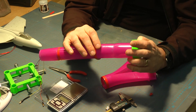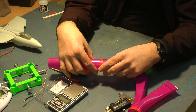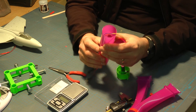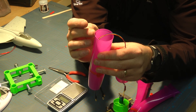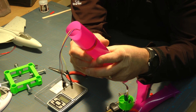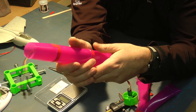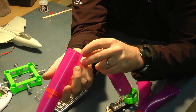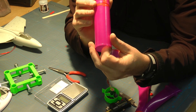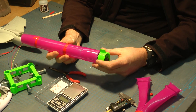So we've got a constant area ducting design on both the inlet and the exhaust. There's another idea I tried that works quite well — it's still single-walled, but as it comes up, there's like a joggle in the plastic. It fits in really tight and snug. When you get the settings right it is very, very tight and smooth, and the transition through the ducting is very, very smooth. All the wetted surfaces — it's like glass.